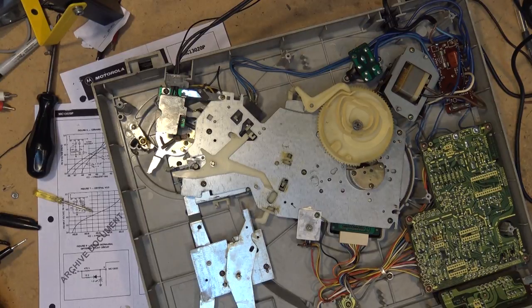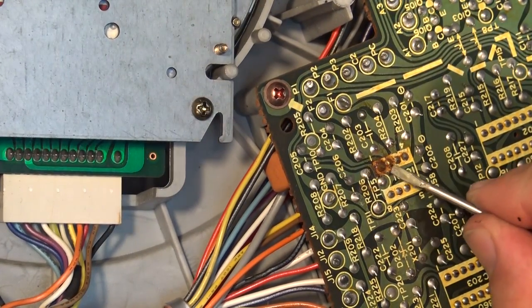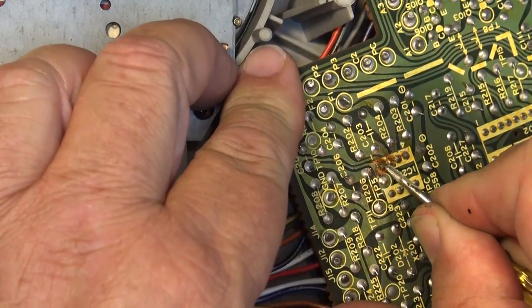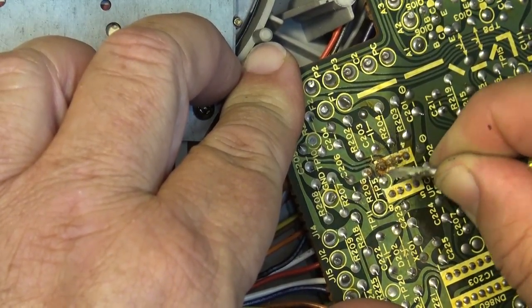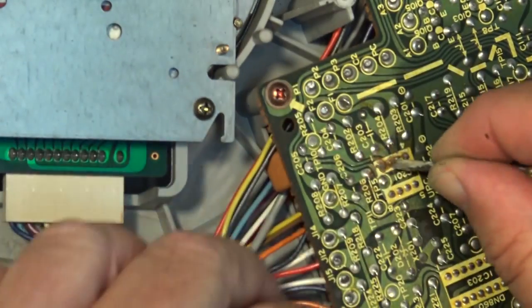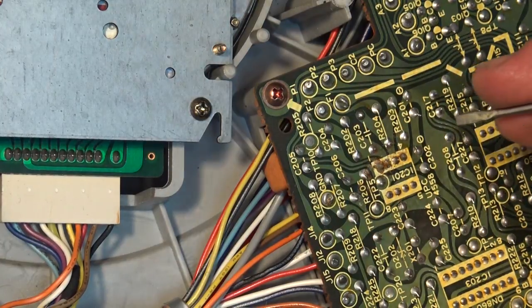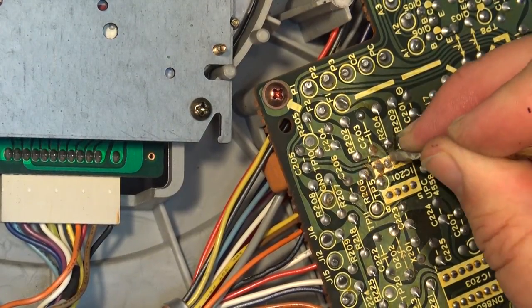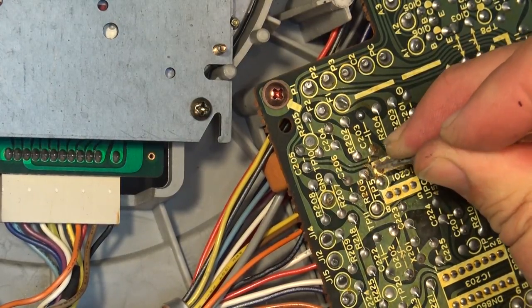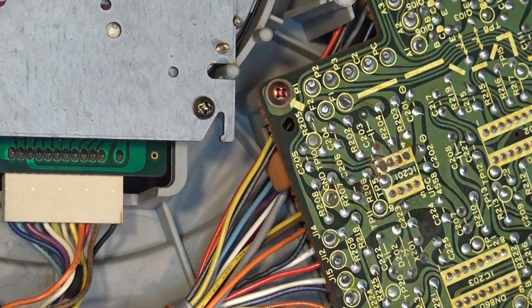I don't like that circuit glue. We're going to get rid of that stuff. This crap that's on the board here. If you look down here, they've got some of that crappy circuit glue here around this IC. This stuff goes corrosive and will eventually attack the traces. So we're going to take that off. Just pick it off there. Anytime you see that yellow circuit glue that they quite often put onto boards to hold wires and stuff in place, anytime you see that stuff, it's got to go. Because what will happen is over time, it deteriorates and becomes conductive. In a case like something like this, you'd end up with the speed going out on it.